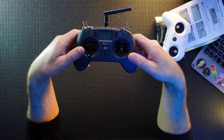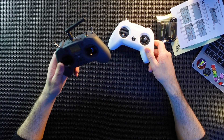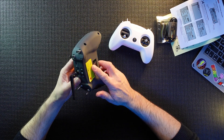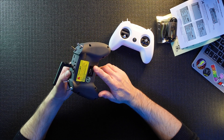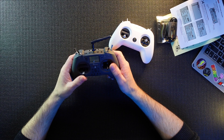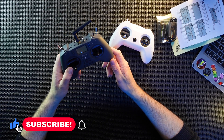She's a nice controller actually. Compared to the Beta FPV, I know it's complaining about price but this is a throwaway controller whereas this is a bit more substantial - you've got the hall sensor gimbals and they do feel quite nice, you've got multi-protocol on there, and that expansion bay you can stick on the back. I'm a little bit sketchy about Crossfire though - I've heard you need an external power source to run Crossfire if you want to go higher than 25mW. That's a bit disappointing, but for the multi-protocol function I think it's quite nice. That's one of the reasons I actually purchased this - so I could try some different receivers.